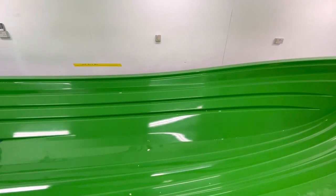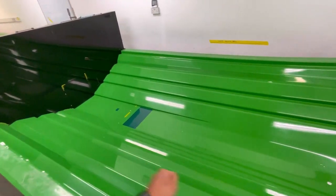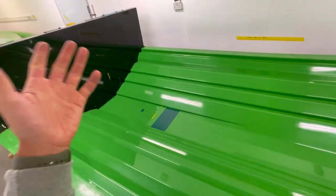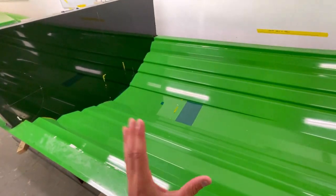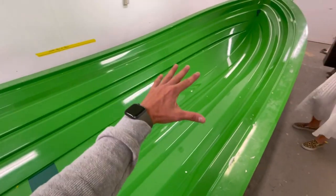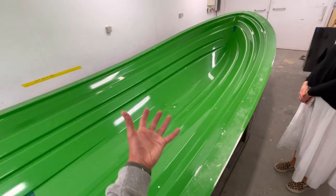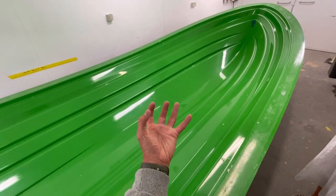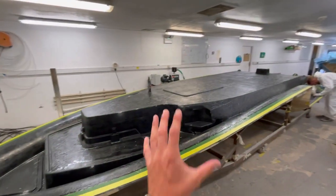You may want to go for black, white or gray. Rather than traditionally painting in gel coat, we use a gel spray gun which sprays the catalyst at the same time, giving you a much better surface finish when we pop the piece out of the mold. It also eliminates things such as fisheying, which is when you get air bubbles in the gel coat — so we get a really good surface finish by using the gel coat spray gun.